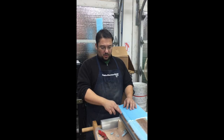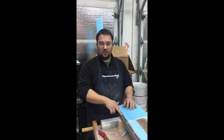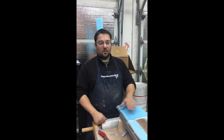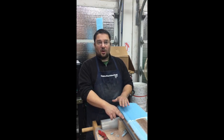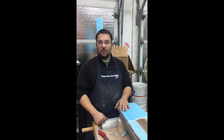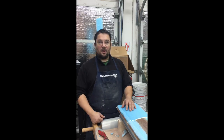On top of that benefit, there's also the fact that now I don't really need to sand off all the micro that would have been sitting here on the trailing edge. We can go right ahead and bond this fiberglass to the fiberglass that's going to cover the top of the canard — a nice glass-to-glass bond with no micro whatsoever to worry about. That's going to be the next step. We'll see you when this thing is done. Don't forget to check the blog at longeasyproject.blogspot.com. See you next time.